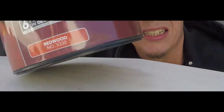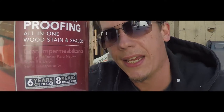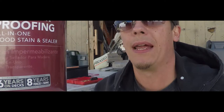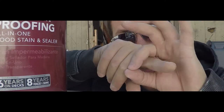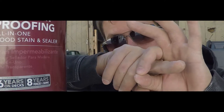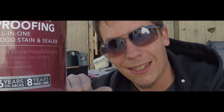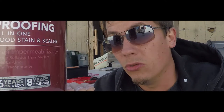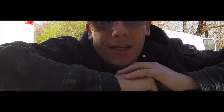I've now sanded this four times. This is the stain we're using today. The thing about stain is it penetrates the wood - once you get the stain into the wood you can't really remove it. You can maybe sand a little more, but once you go too dark you can't go back. I also decided to add a little shelf on top to surround all my monitors - that's what's getting cut right now.